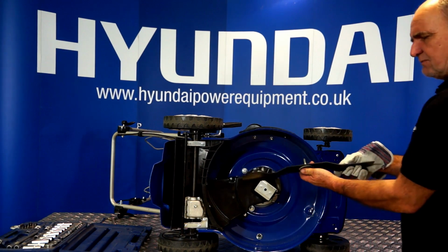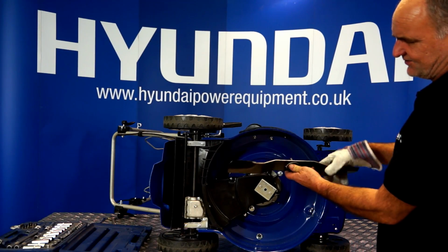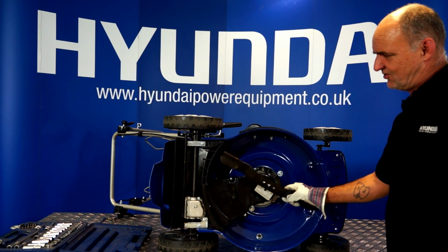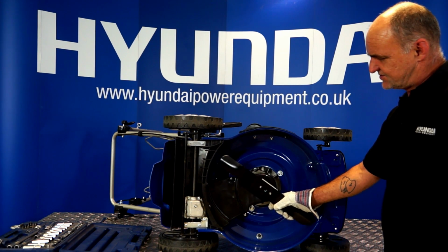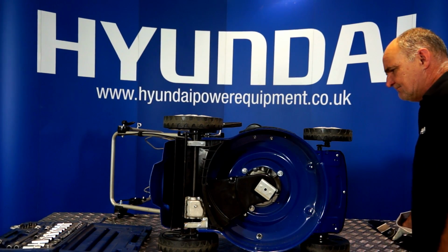Okay, when you come to replace the blade, you'll see that it's dished downwards towards the grass. So when you come to put it back on, remember it doesn't go dished up towards the mower. It goes dished downwards towards the grass and sits on those two lugs. There's just a little tip there.